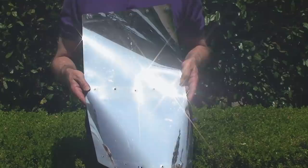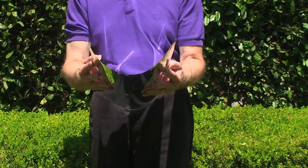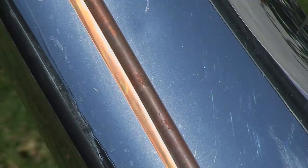Hello, my name is Randall Weatherington and I'm going to show you how to heat water with just a one foot by two foot piece of material. The key to doing this is the concentrated reflection of sunlight. A reflective material is going to be curved into the shape of a parabolic reflector that will concentrate the reflected sunlight onto a copper pipe. Will this work? Watch.